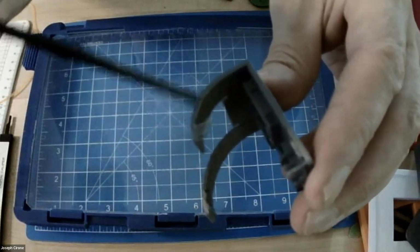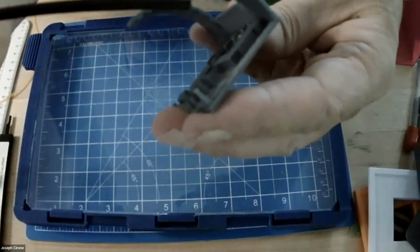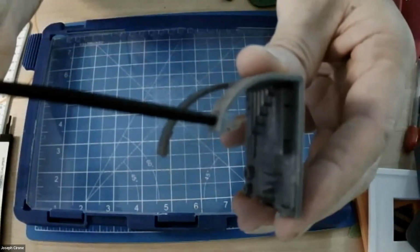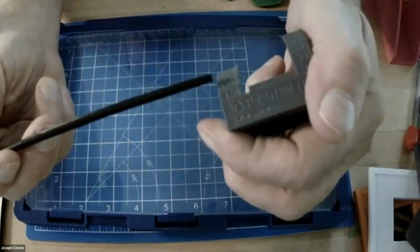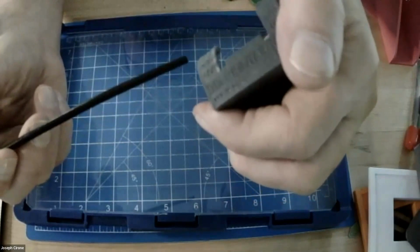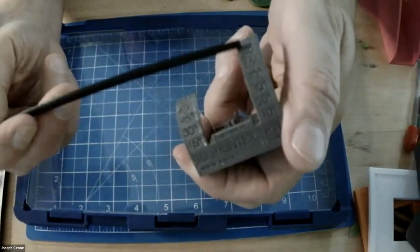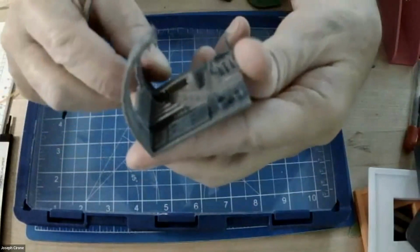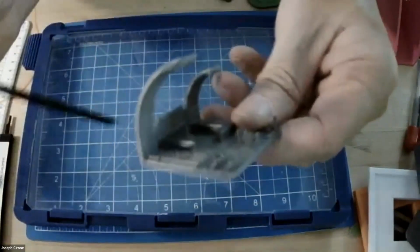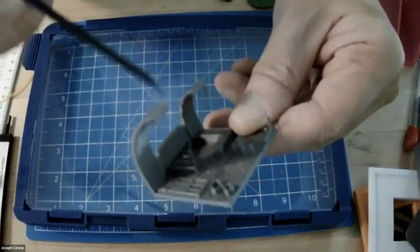In other words, the overhang is just a little bit too much as it gets to the 75-degree angle mark. And so we have 15 degrees, 30 degrees, 45 degrees, 60 degrees, and then 75. And then we can bring this up and over all the way up to 90 degrees to see how our 3D printer will print. And then there's some other examples here too, as far as to be able to see how our bridging is working.